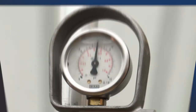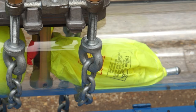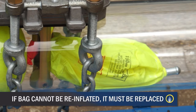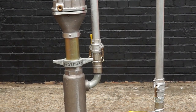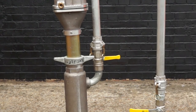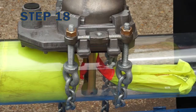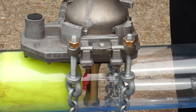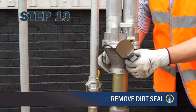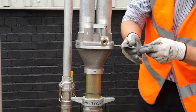Bag failure and replacement. In the event of a bag failure — normally observed by a decrease in bag pressure indicated on the individual bag pressure gauge and possible increased flow of gas from the relevant vent stack — if the bag cannot be re-inflated, it will be necessary to replace it. If either of the primary bags is to be replaced, shut off the relevant vent to stop full mains pressure being released. If either of the secondary bags are to be replaced, it may be necessary to shut off one of the vents, i.e. the relevant bag canopy vent, and then withdraw the failed bag by raising the relevant inflation tube, which should be fully retracted to a stop. Take care not to disturb the other inflation tube. Hold down if required. Remove the dirt seal from its recess in the body. This will allow access for the spatula, which can now be inserted to isolate the appropriate upper bag tube, sliding it fully into the sealing slot.